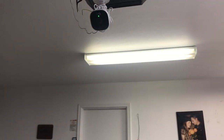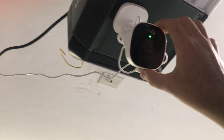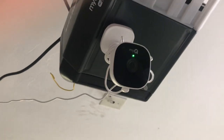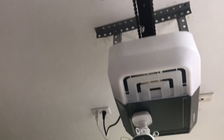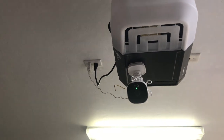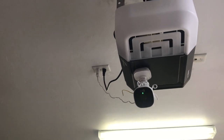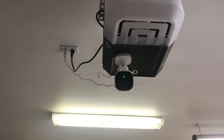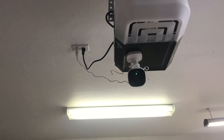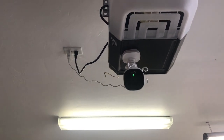This has been a video of how to reset the MyQ surveillance camera. It has a little magnetic mount — you can pull it off, move it, and rotate it when you're done. When you see the green light, that means your camera is live. There's also a paid subscription where you can record surveillance. It's nice to have if somebody's dropping off a package or you want to shut your garage door. Let me briefly go over the steps verbally one more time: the first thing is to forget the device from your Bluetooth settings, then unplug the camera.